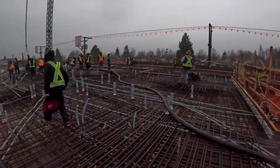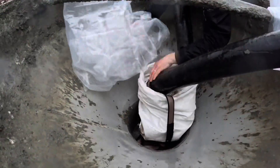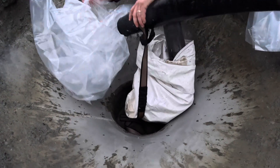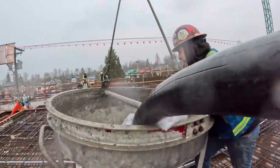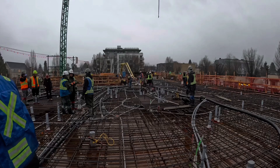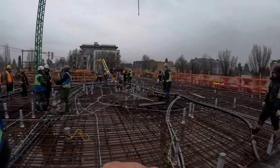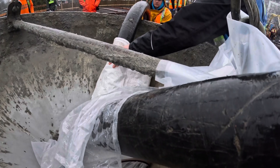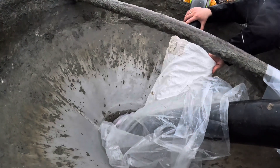We've got the grout on the pump right now, and they're going to prime it into the bucket, so we'll head on over to the bucket and catch that. I want to get them inside these bags — we can do one in that bag and one in this bag. Without the bags, it'll just piss out of that bucket. The grout is starting to sag, which means it's loading up with grout. I can feel it in the hose now. Here it comes — I've got grout through on my side, how's yours? Yep, yep.